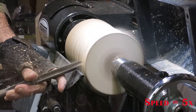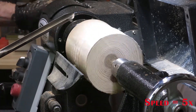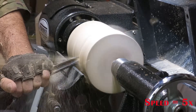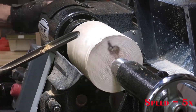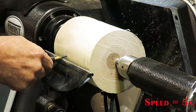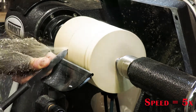I'm starting rough turning the piece here, taking off the bark. There are quite a few wormholes and small defects that I'm looking at, so I'm actually going to be forced to make this project a little bit smaller than I originally thought. Here I'm marking the piece to determine where I'm going to be setting up my area to be carved.